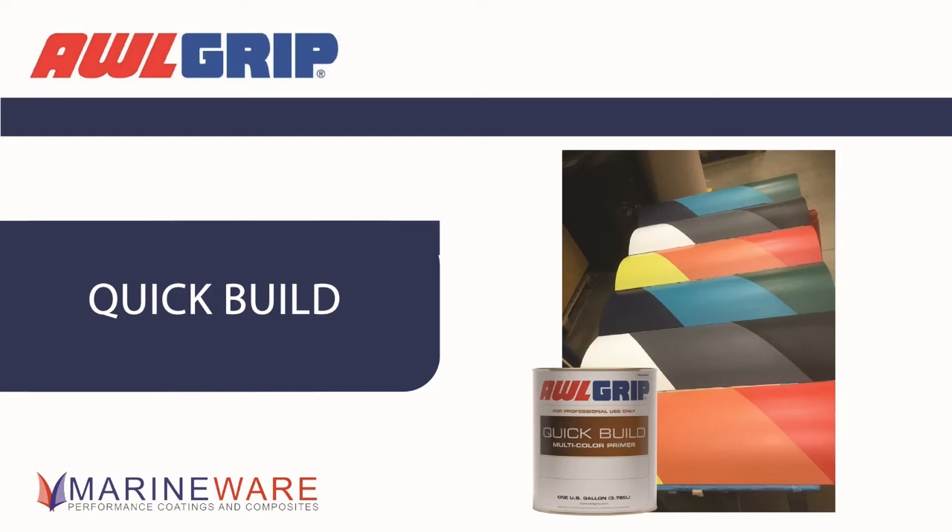This is a polyurethane-based primer, which is a different chemistry to what you might be used to with the epoxy of 545. Should it replace 545? It's not a replacement product — it's meant for particular applications. We have good, better, best in everything we do. The epoxies are fantastic but take longer. If you have the time, use the epoxy. But if you want a fast system, you've got an adaptable product here. It's about adaptability — even hull warranties on new builds can factor into which product is appropriate.